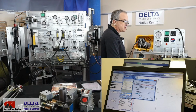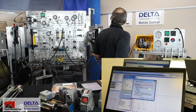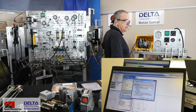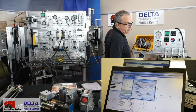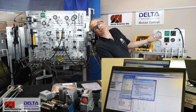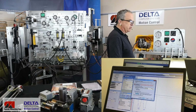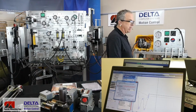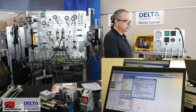So this time it's going to extend the cylinder. And oops, I didn't move to the start yet. Let's move to the start positions. You'll see it's extending our cylinder to a place where it can easily retract a little bit. And maybe the load coming back under gravity might be quite different. Our system is very lightly loaded. There's no major mass sitting on top of it. But still, you'll see the process of it. There's a move negative. And once again, the response of the system was automatically graphed using the MDT to see how smooth that motion was.